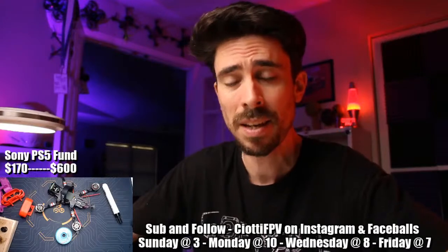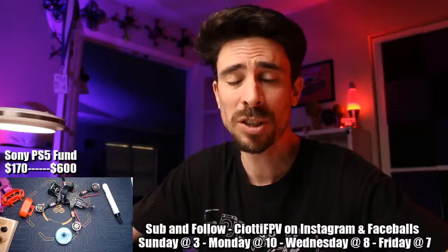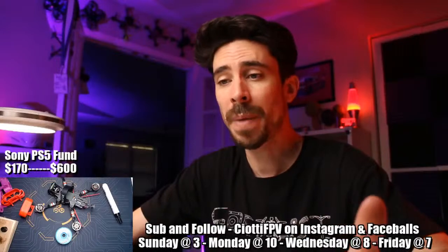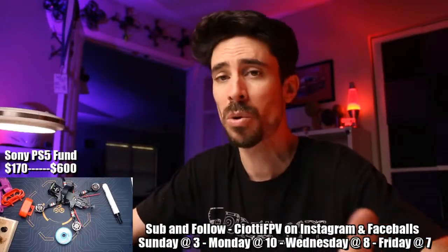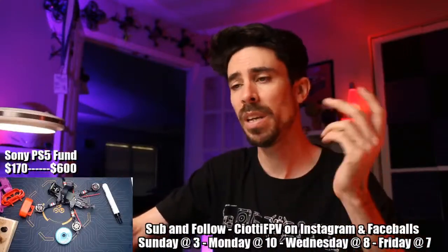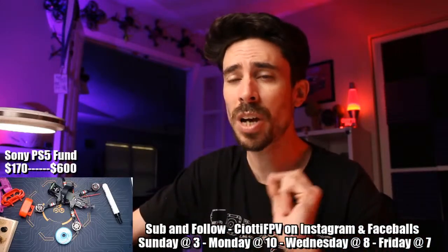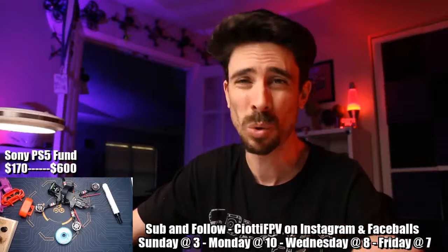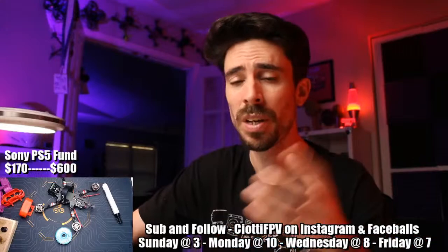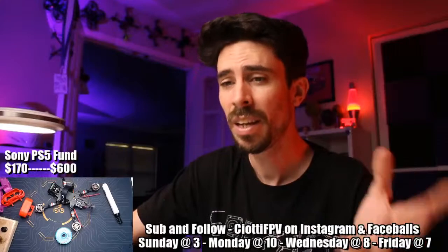When you bench test it, motor limiting sacrifices a little bit of efficiency because bench tests occur at 100% throttle. In the real world, you spend about 3 seconds total through the course of a battery at full throttle, right? Because you blip full throttle and then you come off of it. So even if you use full throttle 30 times throughout the course of a battery, each time typically is like a quarter of a second, maybe a half a second. So in the real world, that particular bench test means pretty much nothing.